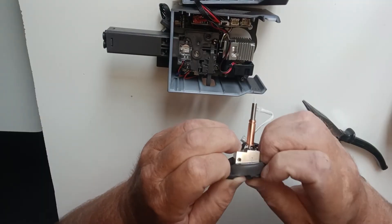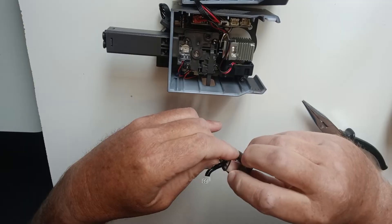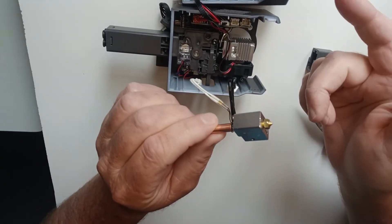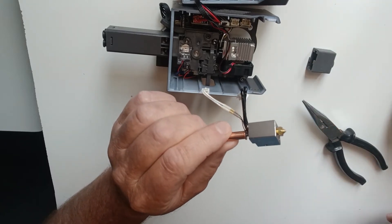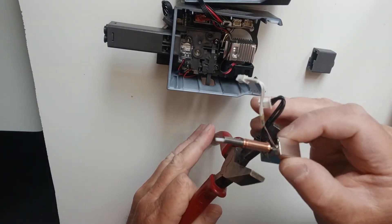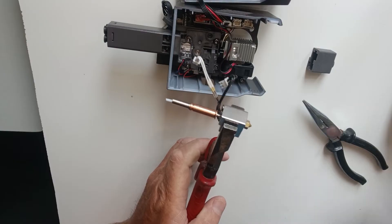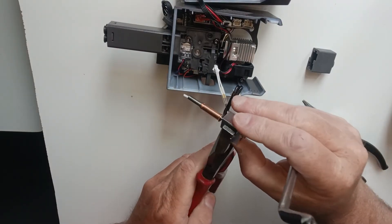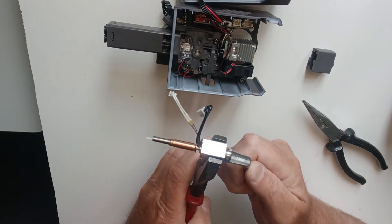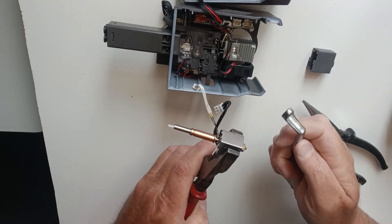Remove the silicone sock, and that's your nozzle. If you want to remove the nozzle itself, it's easier to use pliers to grip it, then use a spanner and just unscrew it. It is quite stiff, but if you heat it up it does come out easier.